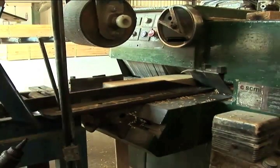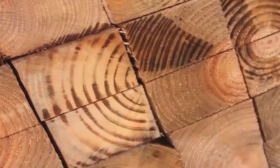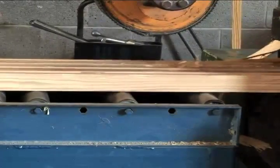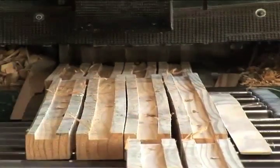The Ripper has the ability to take one piece of wood and produce four separate pieces. For example, it can take one 2x8 and produce four 2x2s. The Ripper allows the operator to align the saws in a way that allows production of a minimal wane product, which is extremely important for export items.